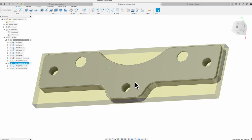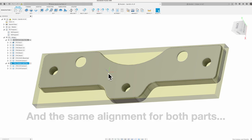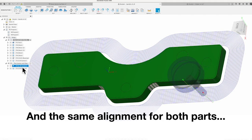All right, once we get onto the back side of the part, first thing you'll notice is our XYZ is no longer up in the corner. So on our jig plate, I'm actually going to probe into the center of that 1/4 inch dowel pin hole that's going to be on the jig plate. And I'm going to use the top of the jig plate as my Z marker. That's going to be my XYZ coordinates. So that's going to be easy to set up. And then on this side, it's just two tools. One tool, and I'm going to use a side milling.